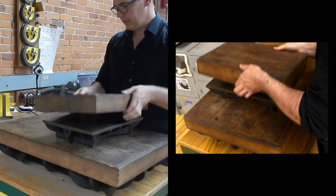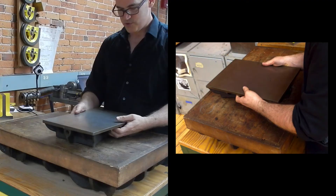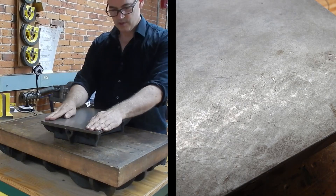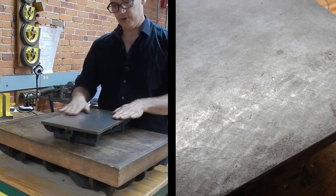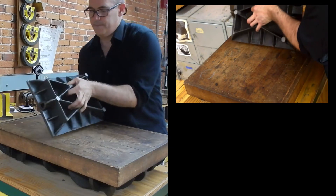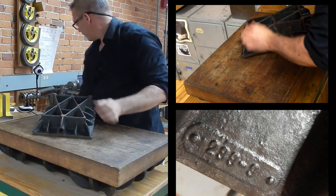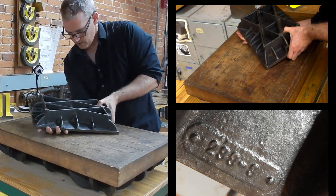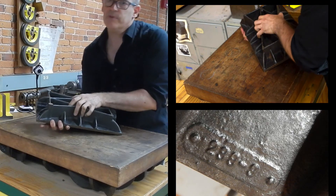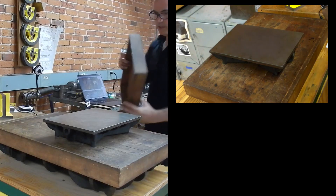This is one of the smaller surface plates — it also has a wooden lid, and it's just as precious as the big ones. I can lift this one to show you the bottom. If you look at the surface, you can see lots of fluctuations because it's been completely hand-finished, which guarantees that as you slide things over you'll be riding on those high points — they're absolutely accurate. You can also see the marks of the hand-finishing. If I turn it over, you can see this incredible web of cast iron that gives it its structure, and you can also see its number. That number has a date built into it — the older your surface plate is, probably the better made it was. And just like with the big ones, when I'm done I'm covering it back up.